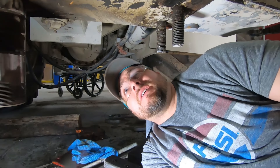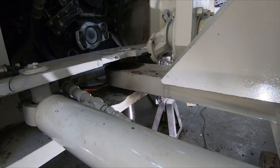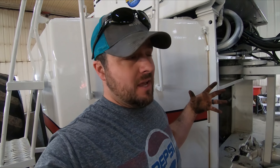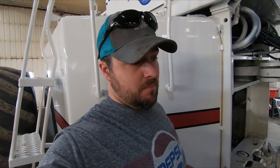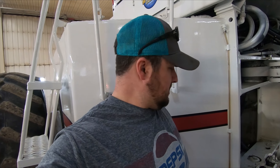Now I just got to try to get that thing loose. It's going to be challenging, but it should come out. As you can tell, there's a lot of slop in that. Something is going wrong between that bushing and the center pin. I believe it's shims that they use to space that bushing in the center of the tractor — I believe one of the shims is missing or it's completely worn out, but I won't know until I actually get it off. I have to take the torch and heat around the top of that pin on the outside to try to expand that metal. As I'm pressing on the pin, it's pushing the whole tractor up and it's starting to bend that top plate, which I really don't want to do. Let's heat this thing up.